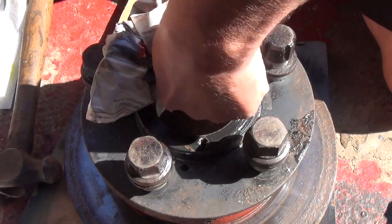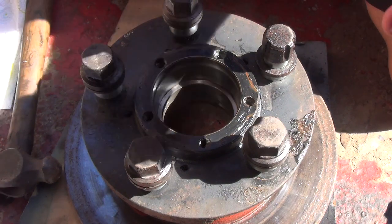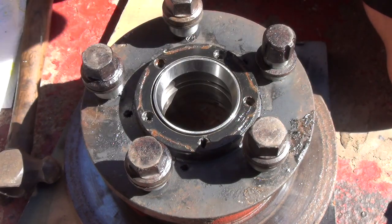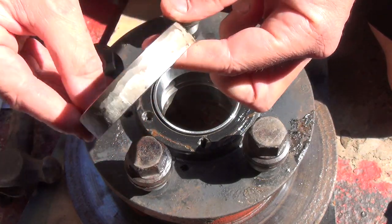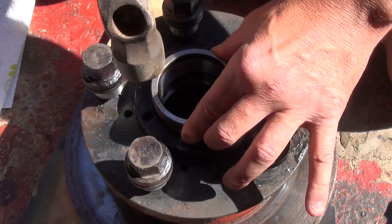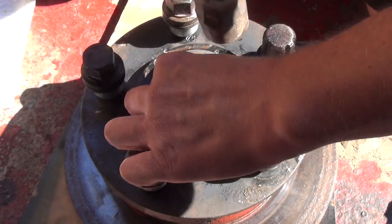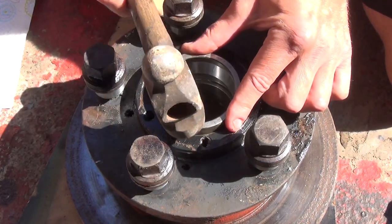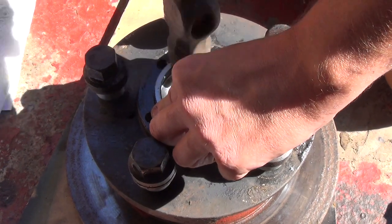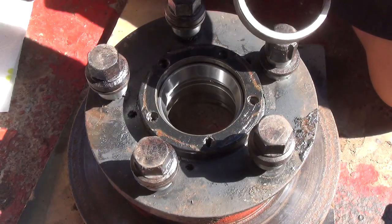Cleaning the inside where it's going to be installed — getting as much grit out — and a bit of lubrication so it slides. That's the new shell. These will take some effort to get in. I use an old shell which has been ground down on the edges because you do not want to hammer this in and get the drift shell stuck as well. I've ground it down so it's slightly smaller than the hole — that way I know I'll be able to pull it back out. Keep checking it's going in as square as possible.